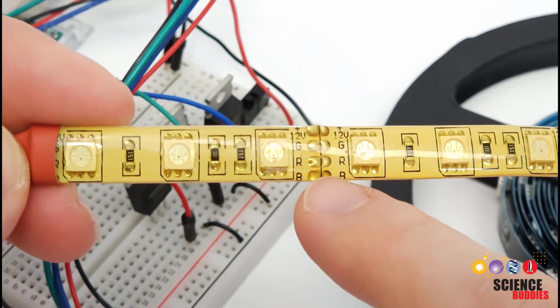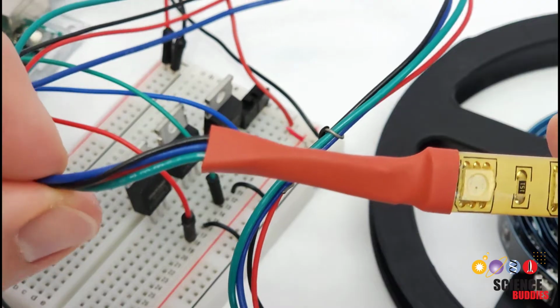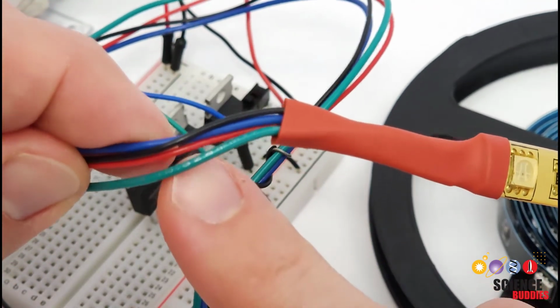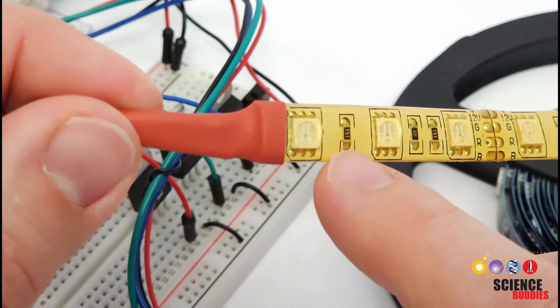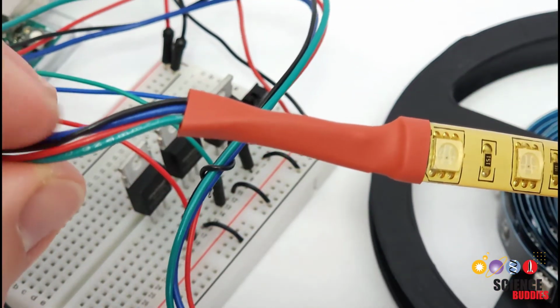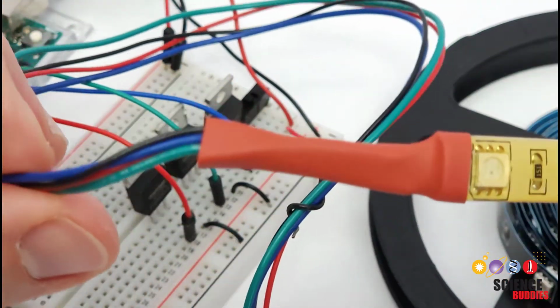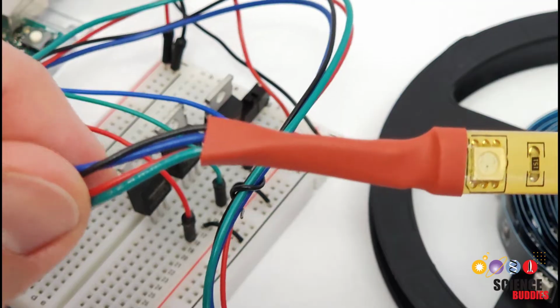You will need to be careful with how you color code those wires to avoid confusing yourself later. If you have worked with electronics and Arduino before, you may know that red is usually used for positive voltage from your battery, but sometimes you might also use it for the signal for a red LED. So in this case, I have used red, green, and blue for each of the corresponding LED colors. And I've decided to use black for positive, even though black is usually ground.